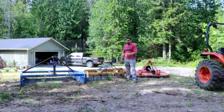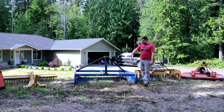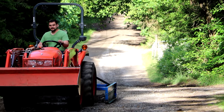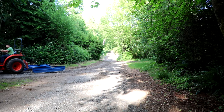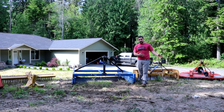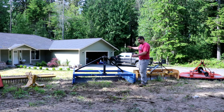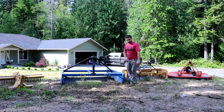This is a must-have if you plan on moving dirt. This is a driveway plane, or a land plane. It's about halfway modified to the quick hitch setup. I got a really good deal on this, and I have a really long dirt driveway — there'll be some clips in the video of me using this. It works phenomenal for creating an existing driveway. The only issue is it's actually two sizes too big for my tractor, so I'm going to modify it to work better — my tractor is really a couple sizes too small to handle the weight of this effectively. I'll make videos about how I modify the three-point hitch and trim off some of the weight and bulk of this implement. But it is great for grading out driveways.